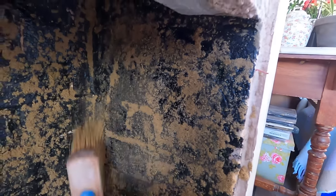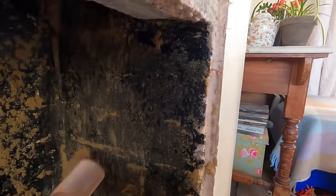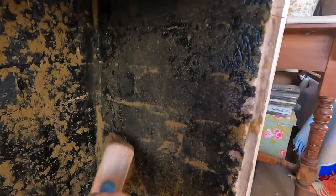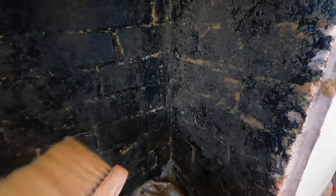This might be overkill, but once the log burner's in it'll be very hard to treat this area again, so we're treating it now with bitumen to stop soot coming through. After about an hour the bitumen has dried completely. Now I'm brushing off the high spots of sand — you don't want to leave sand that hasn't stuck to the bitumen, because you'd put render on and it would just fall off. What you're left with is bitumen with grains of sand creating an almost sandpaper-like effect. Then we're good to mix the render.